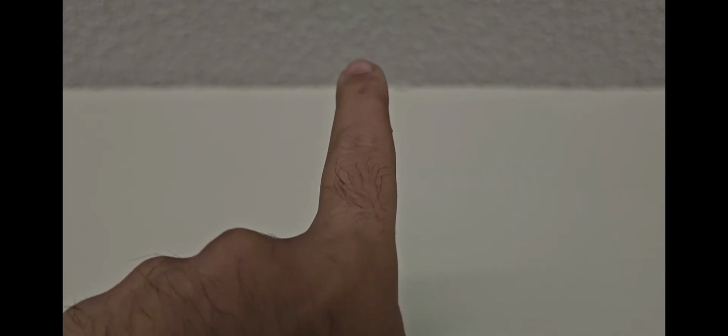Well, regardless, the ceiling is gonna be covered with drywall, but nevertheless, this is gonna be a pain in the butt. The best part is we'll make a hole up there, right at that corner, because that's where the stud is. And then we're gonna have to make another one into the ceiling because we have to punch a hole through the wood, and then we're gonna have to fish the line out. But first, we have to figure out which way the stud is, if it's on the left or the right. So once we figure that part out, I'm gonna punch the hole up above, and then we'll go from there.